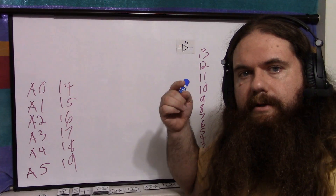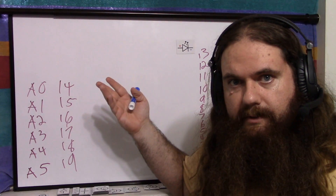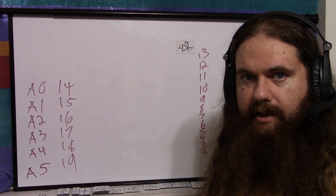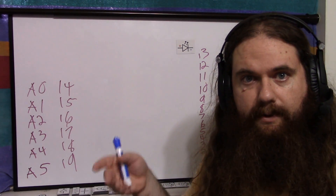Now for input mode. For your pinMode, you've got INPUT or INPUT_PULLUP — it's just what it says on the tin. It's a pull-up resistor built into the chip. There's no pull-down mode unfortunately. It's just high-impedance input or high-impedance input with pull-up resistor.